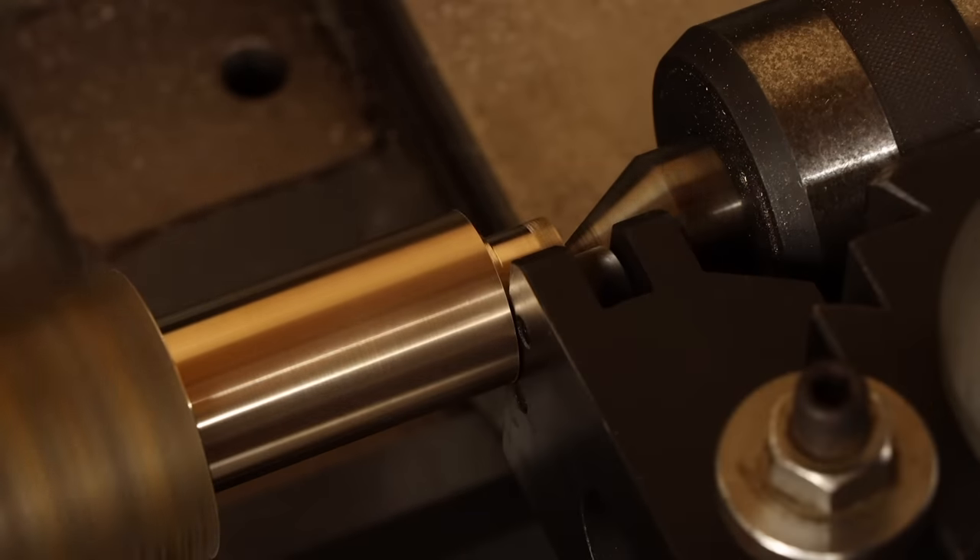But don't worry, we've still got a lot of cool stuff to make. The knobs thread on the spindles, but before we can make those, we need to make the sleeves that go around the spindles. Step one is turning some stock to diameter, and of course we have to sand those tool marks away. Over on the mill, we can drill the cross hole. The collet blocks we made a while back are perfect for this, even if they are a bit out of spec. I'm checking the alignment with an indicator — not so bad after all. This cross hole needs to be aligned as close as possible to the center so it will line up with the cross hole we'll drill in the spindle later. Now back to the lathe to drill and ream the ID. In both reaming operations, I'm pre-drilling about 15 thou undersized to give a good chip and a nice finish. After parting this off a few thou long, we can flip it around, face it to length, and sand it smooth. Then copy and paste — that was pretty easy.